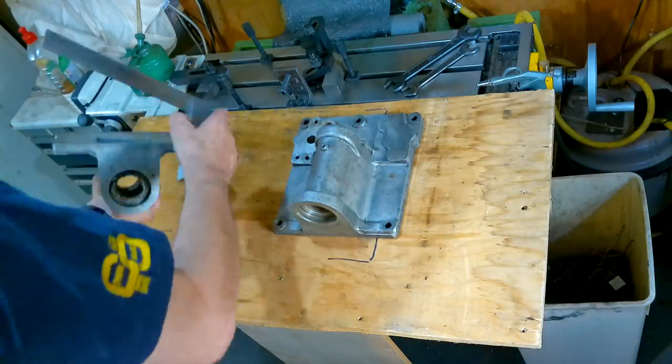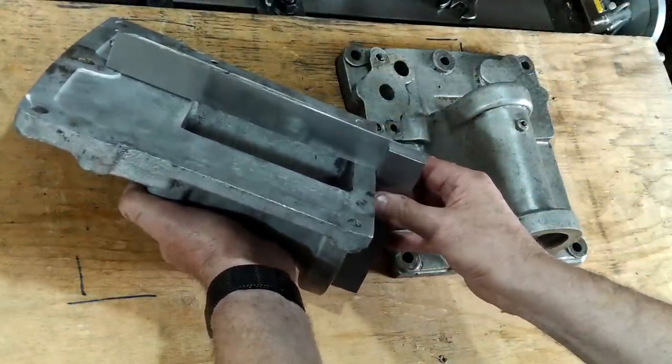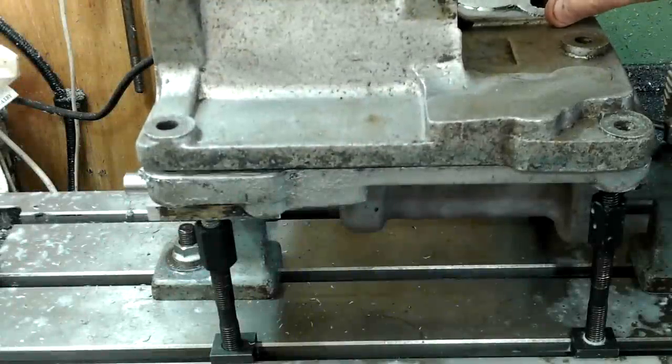After a little foray into some of the issues surrounding these 60 to 70 year old castings, I found that they were at best distorted — distorted up to a minimum of three millimeters out of flat on the back face.